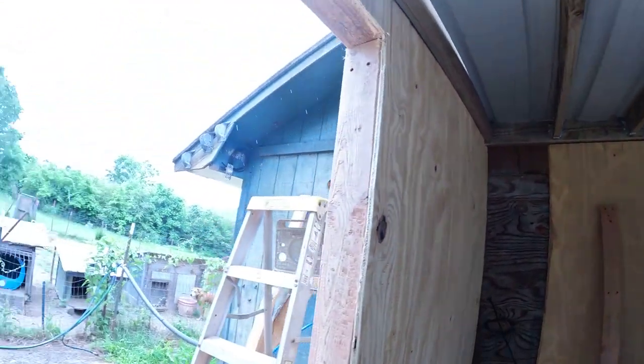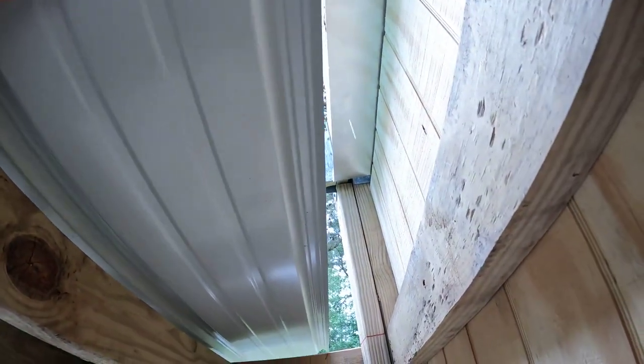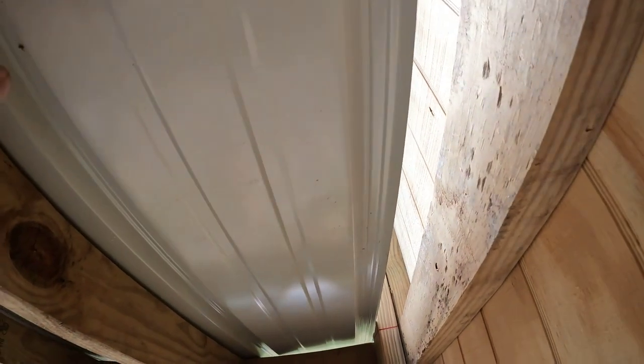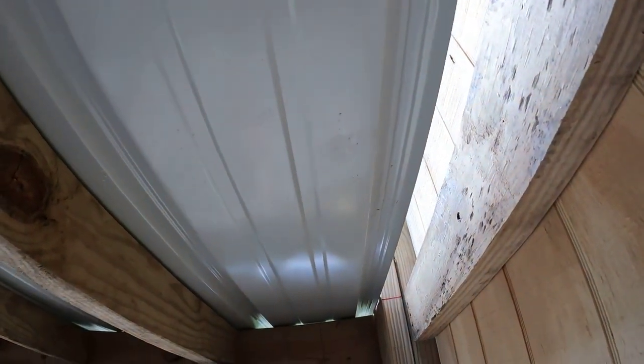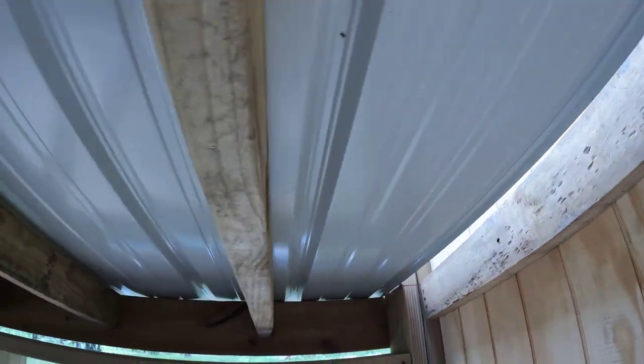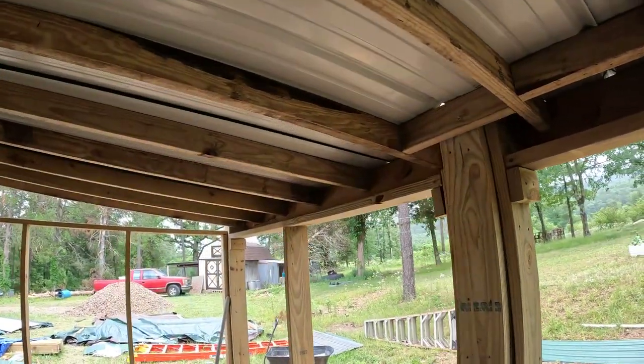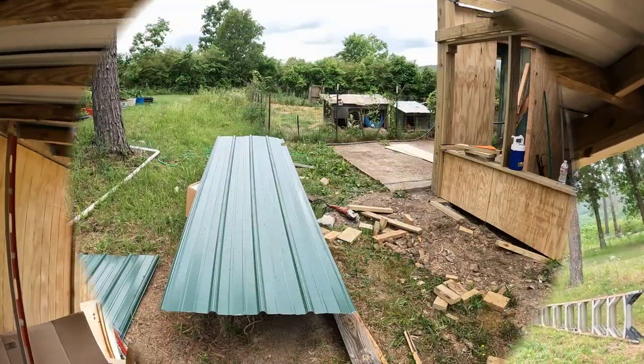Well, can't really see. You'll look up through this crack. You can see this. Let me move this aside. See the flashing hanging off the 2x4? And that'll divert any water. Of course, there's going to be another wall on top of this. But that's, you know, if you join two walls, you got to put flashing if it's exposed to the outdoors. So, I'm going to wait a bit, see if this stops. Try to get a little bit more done. All right.